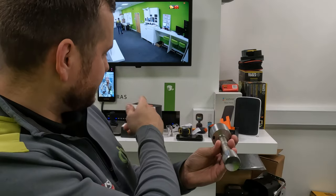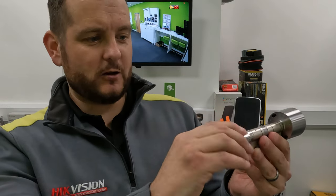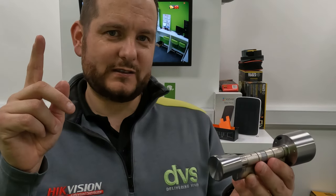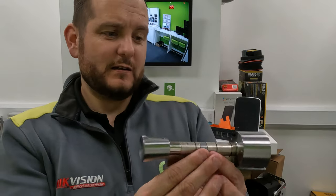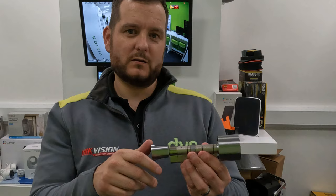Some people have asked what happens if the battery runs out or you lose your phone — great question, and they've thought of that. In the app there's an option to enable a PIN mode, which works like a safe. If your phone has died, or the app doesn't work, or there's no Bluetooth, you can use PIN mode. You have to enable it — by default it's disabled. If your PIN is one-two-three-four, you'd rotate once, twice, three times, then four times — like a safe — and that unlocks it. It's a bit less secure since someone could try to guess it, which is why it's off by default, but it can be enabled if you need it as a backup.